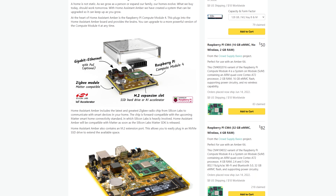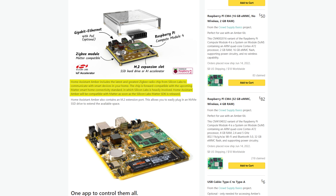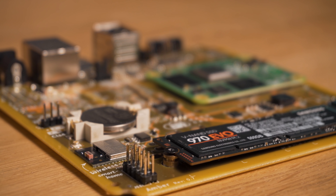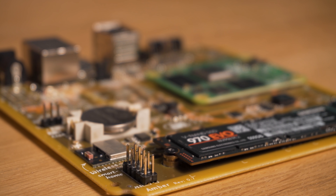They mentioned that this is also going to get the firmware update to Matter and Thread once that is all finalized, so you're getting that future compatibility. And if you look really closely just below the Zigbee module, you'll see that there is a 10-pin header with some of the Raspberry Pi's GPIO pins — not the 40-pin header you might expect on a standard Raspberry Pi, because lots of the pins are already in use from things like the Zigbee module, buttons, or LEDs. But you do have a couple of free GPIO pins right at the bottom of the board.